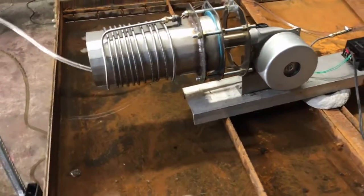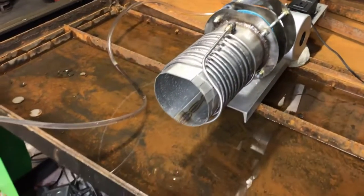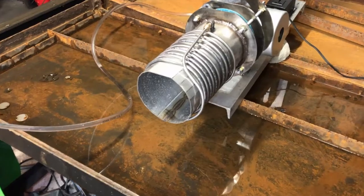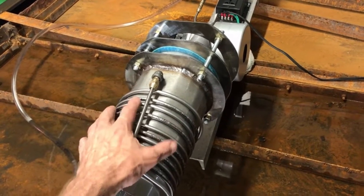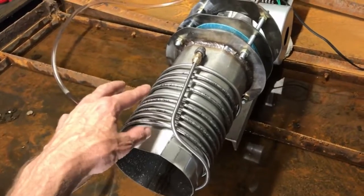But in reality, 25 hours later this entire coil is clogged up — completely useless. Then you've got to pay a guy to clean this thing out, so that's just not practical. We're going to try to come up with a solution and make a coil that's just long enough so that when the oil comes out of the tube it's only at about 300 degrees. We don't want this oil boiling hot, so the size of the coil is very important.